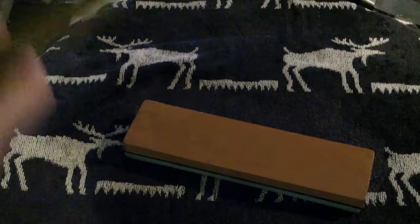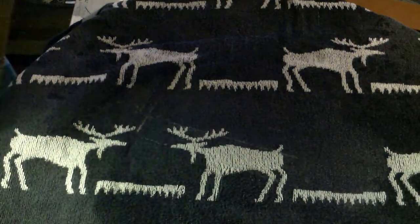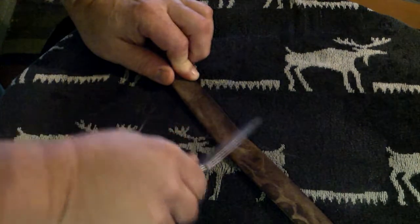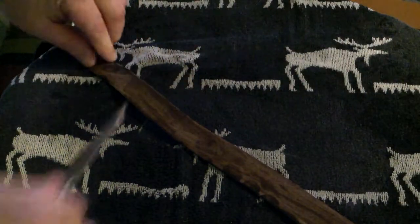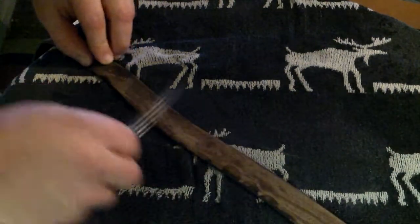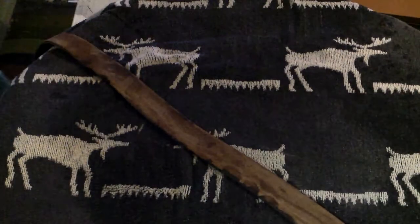Excuse me while I whip this out. This is the belt I'm wearing around my waist. Now to true and polish the blade even more, we're going to do something called stropping. Not strapping, stropping. It's polishing the edge of the blade even more. So if the stone was polishing the edge of the blade, the strop or belt, leather belt, really polishes it, really makes it pop. Now that's sharp.